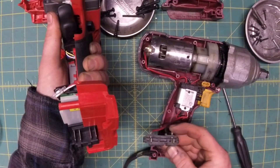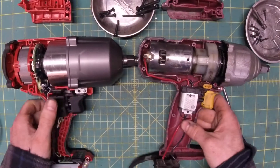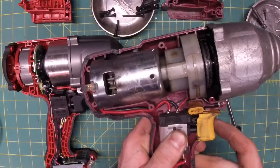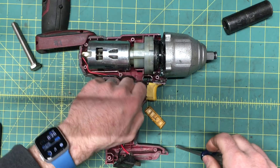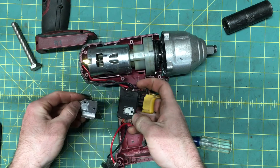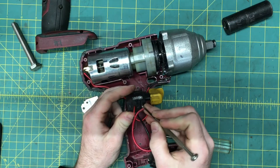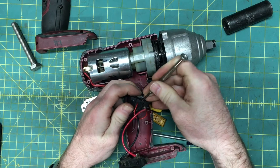Just take a look at the battery terminals — just two. No temperature monitoring, no data communication, just good old-fashioned positive and negative. And the same story with the trigger: just a simple analog device with a beefy heatsink and presumably a potentiometer and a single MOSFET inside. Making a MOSFET-based speed controller is child's play — they're super simple, really cheap, which is why they're perfect for a budget tool like this. Unfortunately, they're also pretty inefficient.